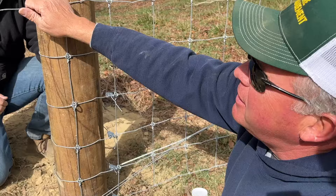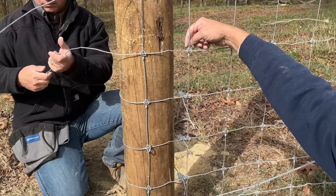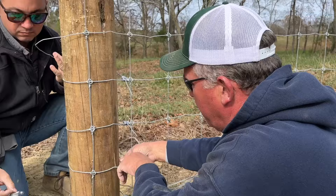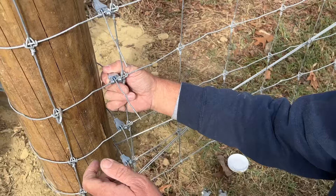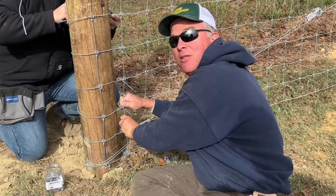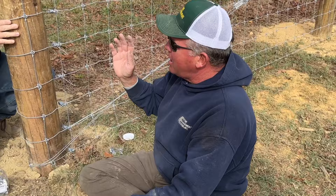This is high tensile wire — it is very stiff, it's hard to work with, it makes your hands tired bending it. A lot of fencing contractors bring this wire around and just simply twist it and wrap it around. There's nothing wrong with that, but the reason I prefer a T-clip is it lets me get this wire on there while saving my hands — I'm being consistent. And right before we tension this, I'm going to want to push or pull to make sure I've got it where I want it. That T-clip gives me that flexibility in positioning the wire on the post that hand-twisting wouldn't. So the T-clip is a time saver and it definitely saves your hands.